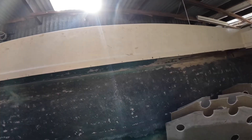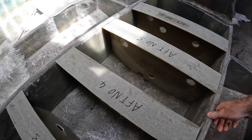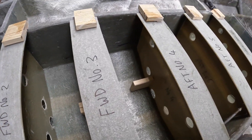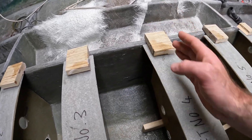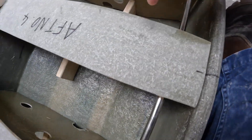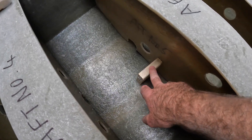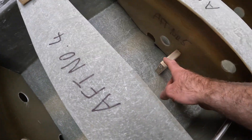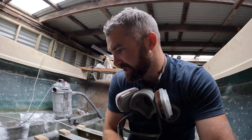Last night I stayed back and finished glassing the baffles. The baffles are just sitting in place roughly — not exactly where they're going to go — but it's starting to look like a fuel tank. I've given the tank an acetone wash and tapped in the baffles with blocks of timber, lining up across the top. This stainless pipe with a tight 13mm hole is holding this side pretty well, and I've cut blocks at 90 degrees and hot-glued them in to give us a perfect 90 degrees, ready to start coving and tabbing.